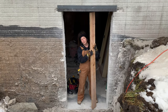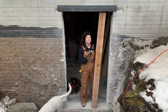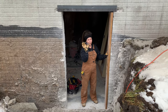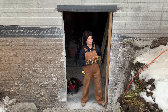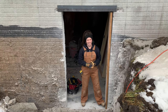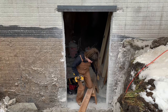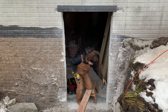The first thing I need to do is attach some framing to either side of my door opening so that I have something to attach my door to. I have two 2x6 green treated boards that I'm going to attach directly to the concrete, flush to the outside of the wall, with these 3-inch concrete anchors. Although you can't get boards wide enough to bridge the complete depth of the wall, you only need them wide enough to fit behind your door jamb — and standard door jambs are 4 and 9/16 inches, so 5 and a half inches is plenty. I'm going to pre-drill my 2x6 with four evenly spaced holes using a regular drill bit, making sure the bit is smaller than the head of the concrete anchors I'll be using.